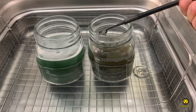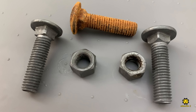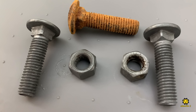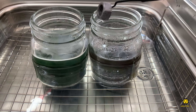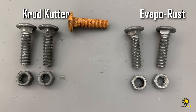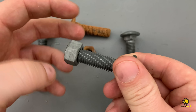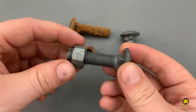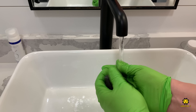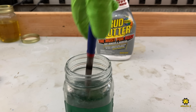After just five minutes, we have a massive amount of rust removed. Just a reminder — here's what those bolts looked like five minutes ago, and here's what they look like after 15 minutes in the ultrasonic cleaner. The rust in the threads is completely gone now; in fact, every bit of visible rust is gone. The nut threads perfectly under the bolt as if it had never been rusted at all. We'll call this test over at the 15-minute mark. I'm going to take them out, rinse them off, and dip them in Crudcutter to see if rinsing and re-dipping helps the rust inhibitor.